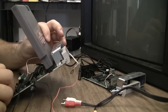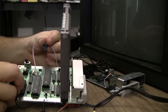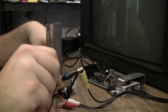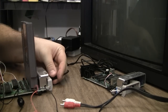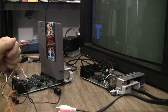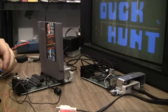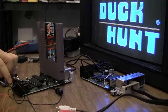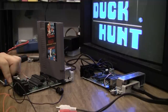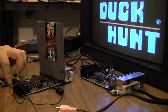What I'll do now is put the original rectifier back in, put the heat sink back on, install the AV mod, and then retest it. Heat sink is back on, original rectifier is back in, AV mod is on. I had to ground the amp out, of course. Now reset works, I don't see any glitches. So I'm going to go ahead and finish it up and put it back together and do some more testing.